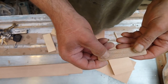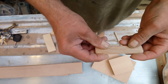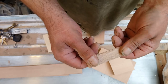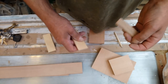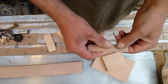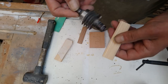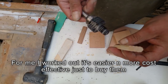And these dominoes, that impression on there that helps the glue stick, it looks like it's compressed in. Biscuits are compressed so that when you put them in and the glue gets on them, they expand. These might do something similar. I can't do that. And I know that wood on wood sticks fairly well for what I'm doing. I'll just plane these smooth. Those grooves that I made that allowed for the glue, I made with this cutter. I'm not going to do that with these.